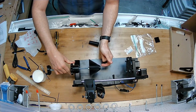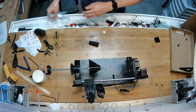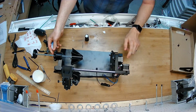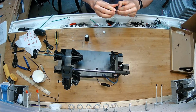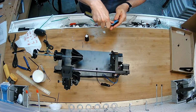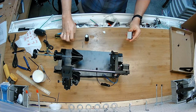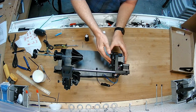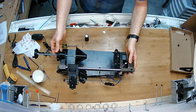Anyway, insert the part, and I did not use my spare bits. I did not use this yet, so the heatsink goes on the motor that is more stressed, which is the rotational one, because it has a large normal load on it while it operates. So just peel this off and stick it on in whatever orientation you want. Push on real good, and that is how you build the CylinDraw.